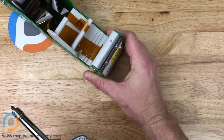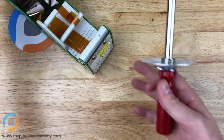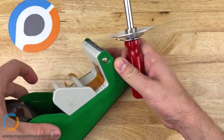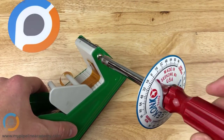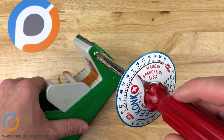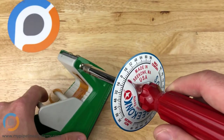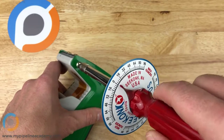We've got this little Kapton tape dispenser here — quickest thing I could find that has a screw in it we could use to kind of evaluate and play with. I might have this screw right here, and as the mechanical designer I might say, okay factory worker, don't put more than 64 inch-oz of torque on this, because if you do, I already know based on some experimentation that it will strip, and we don't want that to happen.